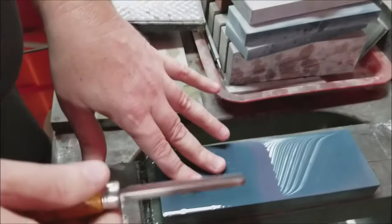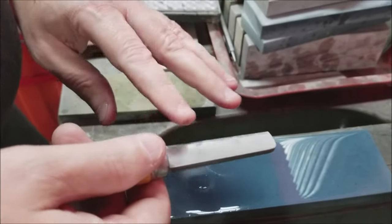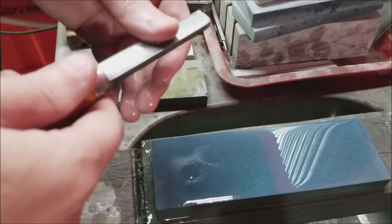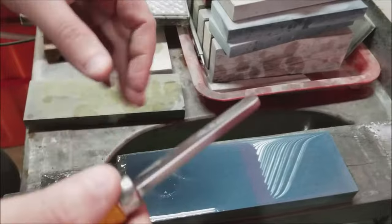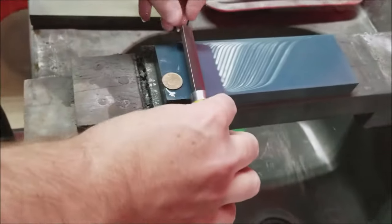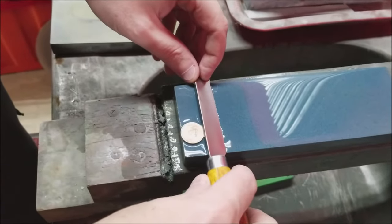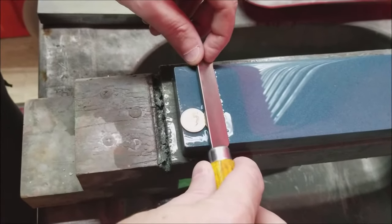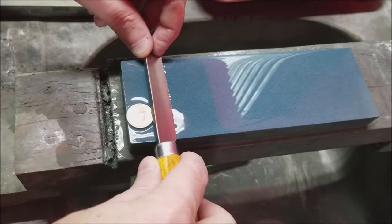Our first stone is going to be a 600 stone here to clean up the belt. And the process here is the same. We usually use the dime nickel method, which is in our book, the Jende Book of Sharpening, and I'll put a link in the description. So for the first step, we're just going to clean up what we've done with the belt. We put the knife on the lip of a single coin, and that's our raised angle. So this is the lower angle, and then a double coin would be the higher angle, or the nickel angle in the book. So just for quick reference.